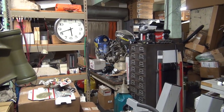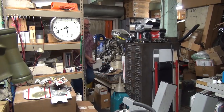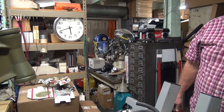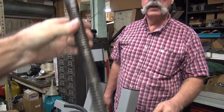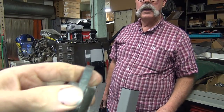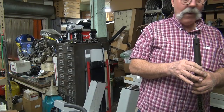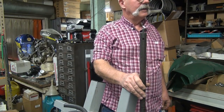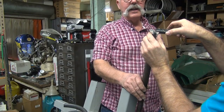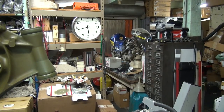How's it look? This isn't the one we had — oh, because we cleaned ours off. But this is another new old stock one I believe. I like having new parts so I use new parts wherever possible — not new Taiwan parts either. What diameter is this? I can't tell — quarter inch? You guessed wrong. In Milwaukee they probably used something standard. That is 0.317. They'd call that 5/16 of an inch.